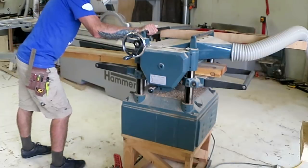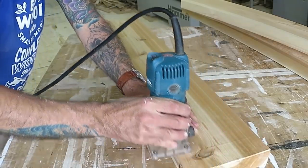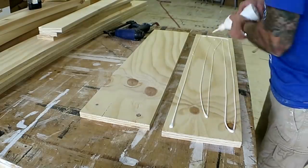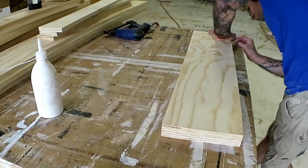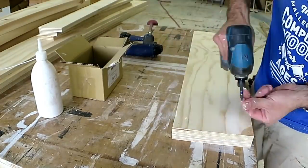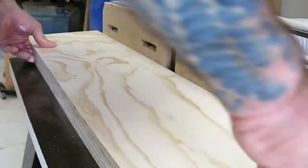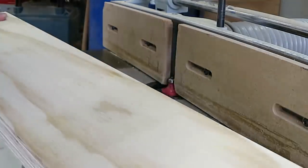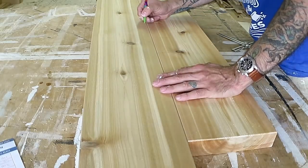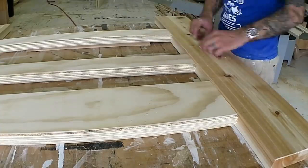Okay, so I had some pieces of 200x50 knotty cedar left over from the barn door build I did not too long ago. So I used those for the legs, and I had a few sheets of plywood kicking about, so all the rails are plywood glued, pinned and screwed together. Then I could add a nice round over to all the edges, and sort out the layout for the cross rails that will be the ladder end and also the headboard end where there's just a single rail.